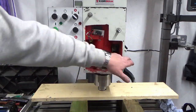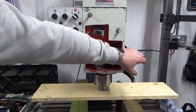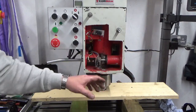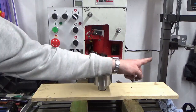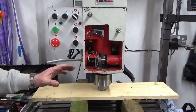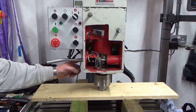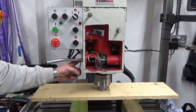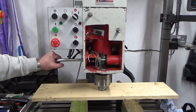And we've taken our hand wheel and our quill slow fine feed casting off. It's just 2 bolts, dead simple. And we've taken the pinion shaft, slid that all the way out this side. We've also backed our key grub screw off that sits into the keyway in the side of the quill. So the only thing holding that quill in place at the minute is the quill lock.